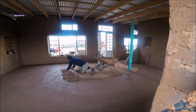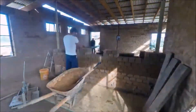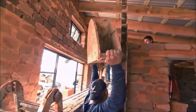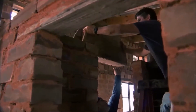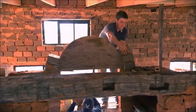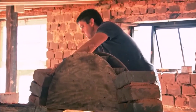They get the three-inch base layer of mud troweled onto the entire floor and switch gears into block-laying mode one last time. To connect two interior walls for the bathroom, Ryan and Melissa will build a block arch. They use a wood template to lay the blocks on to form the arch — it looks really cool. It's just another really cool artistic thing you can do with compressed earth blocks.